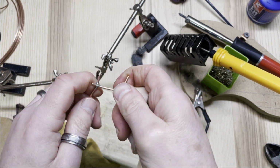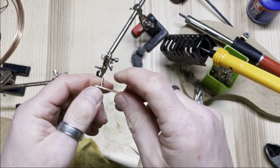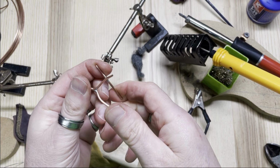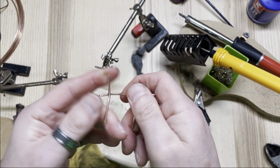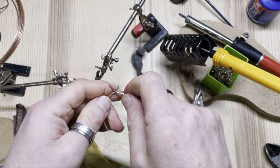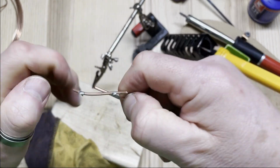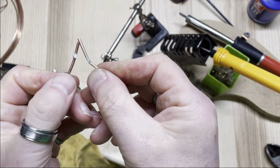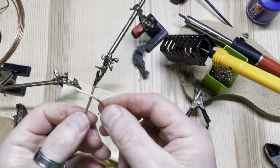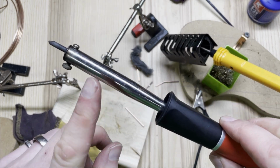So completely unable to break the joints. So if you're doing sculpture work or rolling ball art, kinetic machines, things like that, not just electrical connection, but actually something that's physically strong. There, that one's gone. And that one's gone. Managed to twist it off. If you're doing something that physically needs to be quite strong, then either will give you a good joint, but I just find it a little bit easier with the resistance iron.